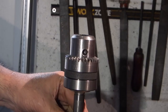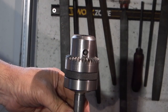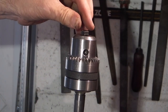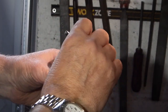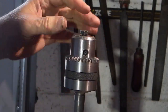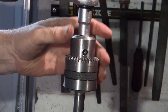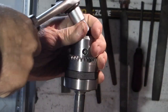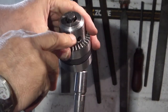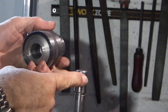I've put the Jacobs chuck to hold it on the tang in the vice to remove the chuck from the morse taper. What I've done is I've just got a nut and bolt, put that down into the chuck jaws, tightened the chuck jaws up on the nut, and with a socket just turn the bolt. If it's tight and won't come undone, just hit the bolt with a hammer to shock it and it should break the seal.